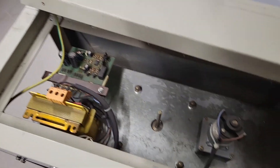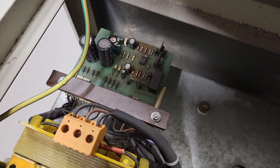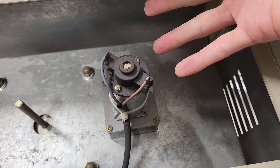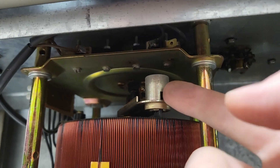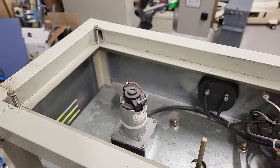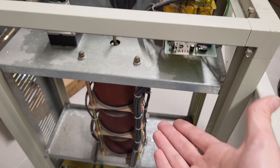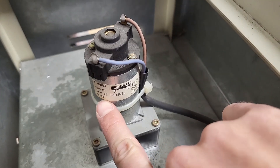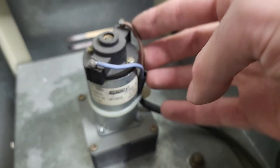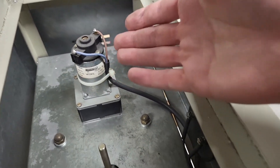Inside it's a pretty simple circuit: a small transformer — most probably three-phase — and an electronic board with very few components. The key part is the motor that drives the variac. Down there, the motor gear connects to a chain which links to the shaft that moves all three variac sliders automatically and in sync. I want to test if the motor still works — its label shows 24V DC, so I can power it directly from my bench supply.